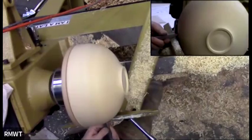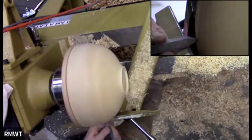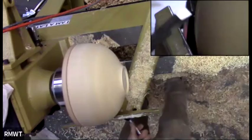not a lot of light here on my side of the lathe. A little high spot. Yeah, I got a little bit of a chicken cut there. And it's gone already, that burr. This is only 3/8 wide. Normally, I'd like to use a 1-inch wide, but I didn't bring one with me. I forgot to bring a wider one. So it's just a little high spot here where I blipped with a gouge.